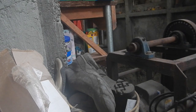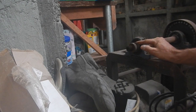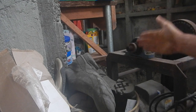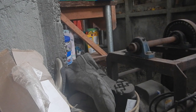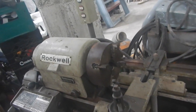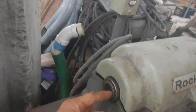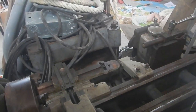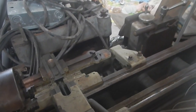So I guess that's my first task on my lumber mill situation. And this needs to be really, really precise, because the thing's gonna be spinning like crazy, and if it's not centered, then it's gonna be wobbling, vibrating. So, okay, how do I do this? To carve that part, I could stick that rod in my lathe, except it won't fit through this hole back here. So it would have to be sticking way out, and I'm not confident that I can get it centered well.